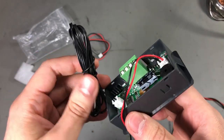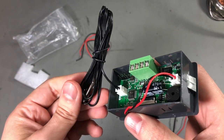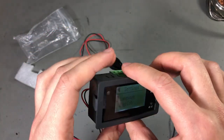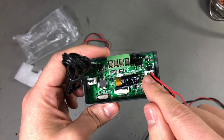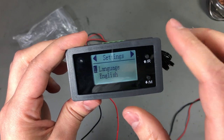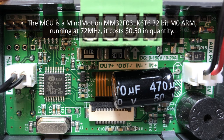For temperature measurement it uses a standard 10k NTC thermistor through a JST connector. They provide a sample thermistor in the package but you could easily replace it with another 10k thermistor in a different package for easy attachment to a heatsink, for example. You also get an auxiliary power input so you can measure down to 0V without losing power to the meter. This panel meter pretty much does everything you'd want — it should be great for your next power supply or dummy load project. I'm really happy with what I got for the money.